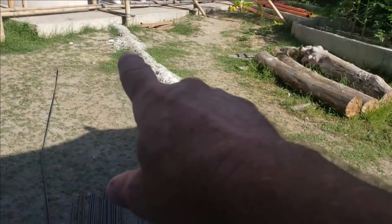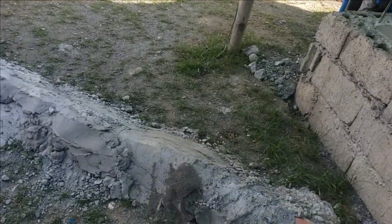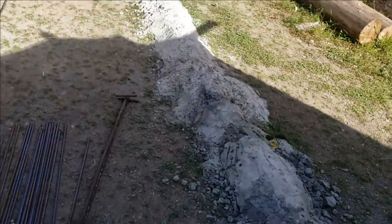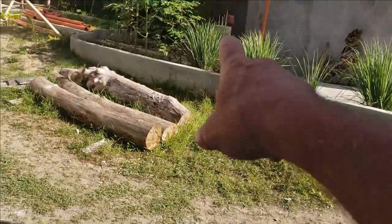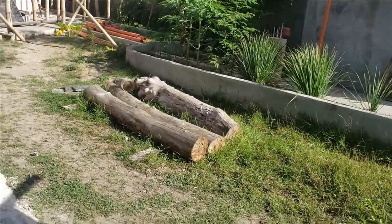And we've been taking our leftover concrete and encasing this PVC tube going out here to this tank. That too will have soil all over the top of it and you won't see it. And the reason I put the concrete, one thing, it gave it some protection right now. And another thing is that if somebody decides they're gonna plant a tree or randomly dig a hole, things people do, taking that bar they use to stab into the ground, that spade looking bar, they'll hit that concrete, know something's there, and they won't bust open the PVC pipe. So every time we have a little project and there's a bucket or two of concrete or rendering left over, we encase the pipe here. We did the same thing for the sewer pipe over there too, going right along that bed and going up here to the septic tank right through Melinda's little garden right there.